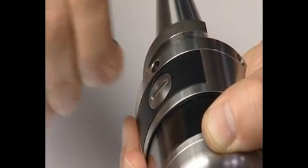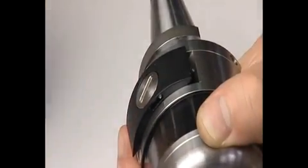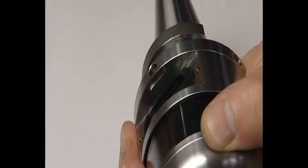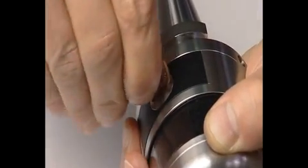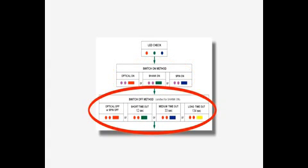To review the current probe settings, remove the battery cassette for 5 seconds. Then reinsert it. When reviewing settings, do not deflect the stylus. The probe now goes through a startup sequence: an LED check, the switch-on setting, and the switch-off setting.